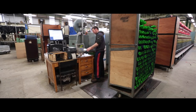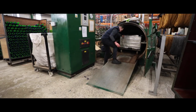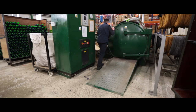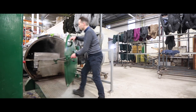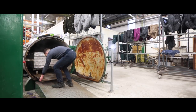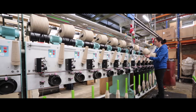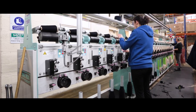After spinning, if the customer wishes to buy our yarn or product in oil, they will knit their garments and wash the garments themselves. If they are buying it in oil, it can go to twisting, where two ends are twisted together, which gives a nice chunky effect. Or else the yarn can go to the autoclave — the steaming machine — where it is left in for an hour. This basically deadens the yarn and makes it easier for the weaver or knitter to work with. It takes the life out of it. Then this goes to coning, where the yarn is wound onto a cone and packed into boxes ready for the weaver or knitters.